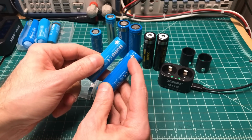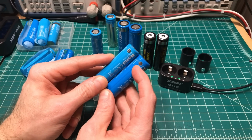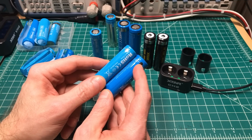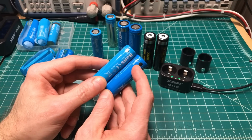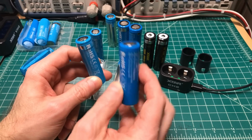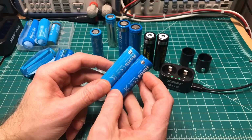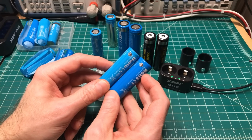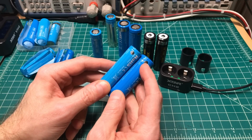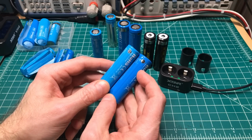But in having this exposed side contact, if you have a mechanical vaping device, a mechanical mod, and it doesn't have a liner, and this side contact touches the side contact of the mechanical mod inside, you can either have an auto-firing situation if the positive's up, or if the positive's down, you can short circuit the battery when you press the button. That's bad. There can be a fire, an explosion. It's just really bad. And that might be an issue in flashlights. I don't know if the negative side contact touches the inside of the flashlight. Is that a problem for some flashlights?